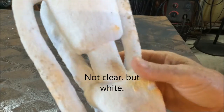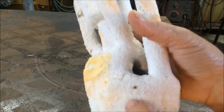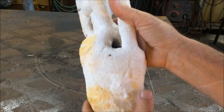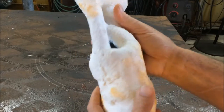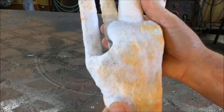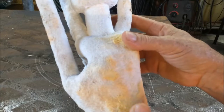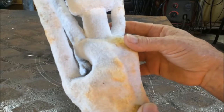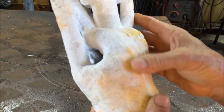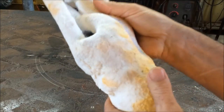To prepare the shoe for making the mold, it's pretty simple. There was a flap that I glued down with hot glue because it wanted to be wild and didn't want to lay flat. The fabric part of the shoe was very porous — I was concerned that the ceramic shell would go into the fabric rather than over it, so I sealed that with a mixture of melted wax and paint thinner, making a kind of varnish to seal it up.